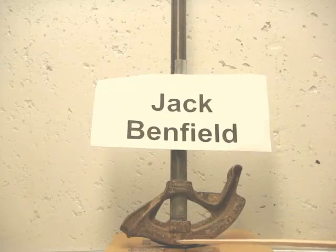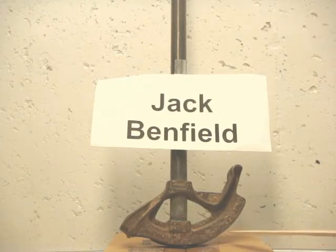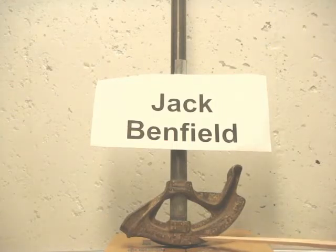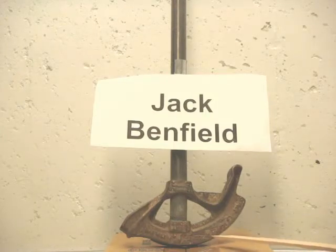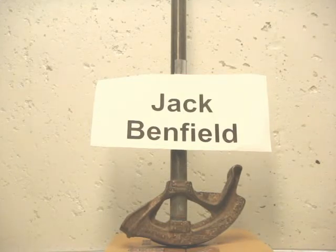And this side of the bender has lines that correspond with the angles on the other side, but instead of the degree markings, it has the inch markings that you would need per inch of offset for that degree bend. In other words, a 30-degree bend for an offset would require 2 inches between each mark to achieve that type of offset.